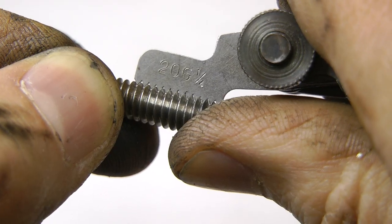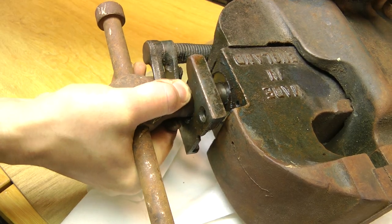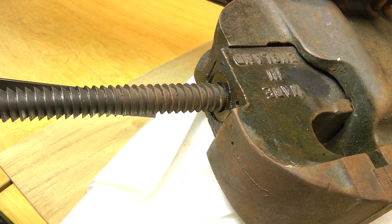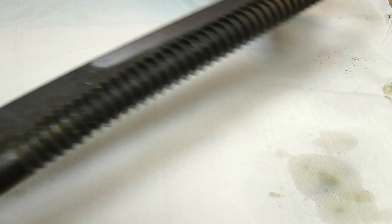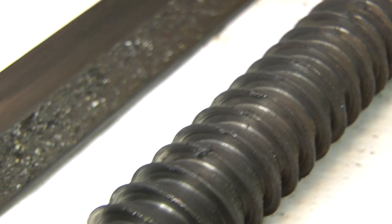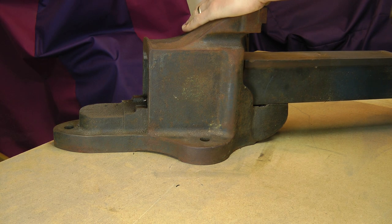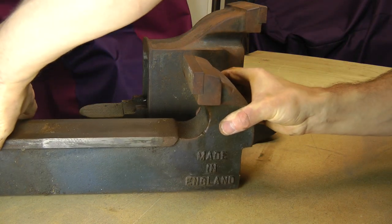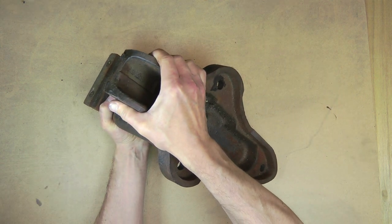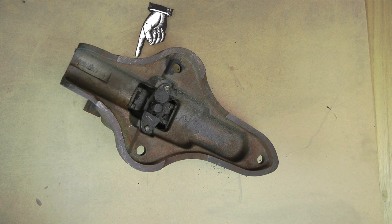That meant I had a couple of Whitworth screws to find before I could put it all back together. Here I'm putting tension on the trigger so the rocker bar doesn't unwind when it clears the half nut, and then withdrawing the lead screw and quick release together. Although it's definitely seen some use, there's not much in the way of wear on the thread. With the screw removed the dynamic jaw could be slid free. Whilst it was upside down I spotted a stamp — I'm not sure this model was available in 1927, so I'm guessing it's an inspection mark or a pattern number rather than a date.